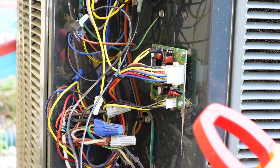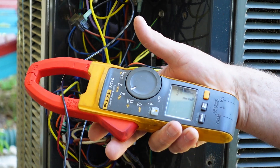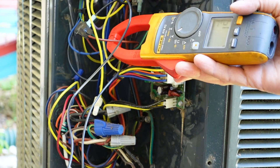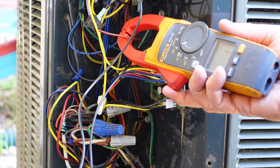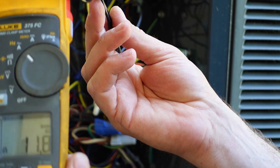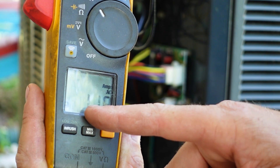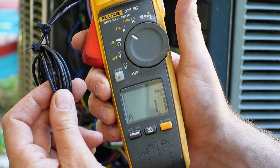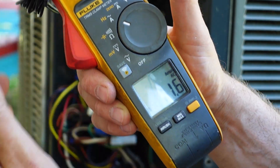Now we have our wire wrap hooked up to a condenser fan motor. This is an EC motor — maybe not the best example — but you see we get 1.1 amps there, and in the unit we might get a slightly different reading because we're near other stuff. When we go to our 10-wrap, we get a reading of more like 1.18 to 1.19, because we're moving that decimal point one place to the left. You gain a bit of resolution by doing this. It's not always necessary, but it's a useful tool to have in the toolbox when and if you need it.